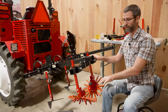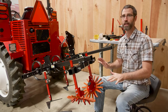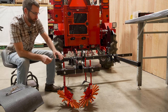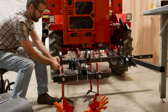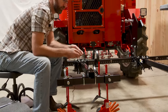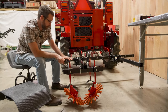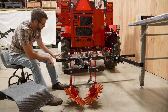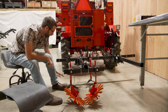So that's adding on the finger weeders. I did that pretty quickly and just got a rough adjustment. What we're going to do now is tune in everything and make sure things are adjusted the way we want for getting ready to go to the field. Looking at the backside of this A-blade trailing arm mount, there are clips that come in and can be added into the top of the flat shanks — these keep the shank from completely falling out and getting lost in the field if it gets loose. I lowered the toolbar to the ground and made sure it's parallel.